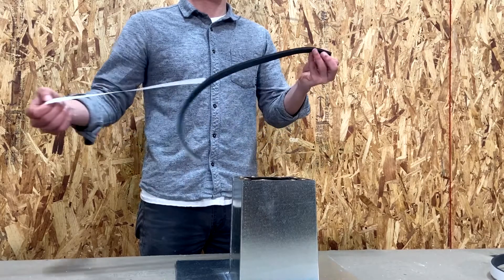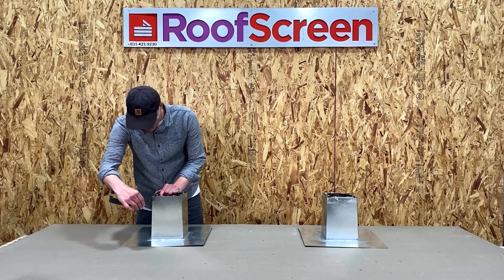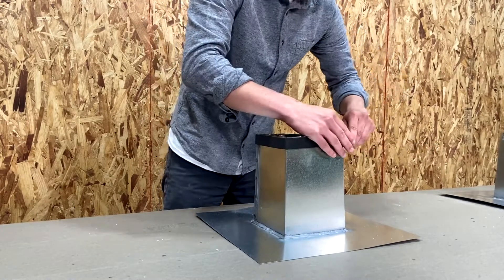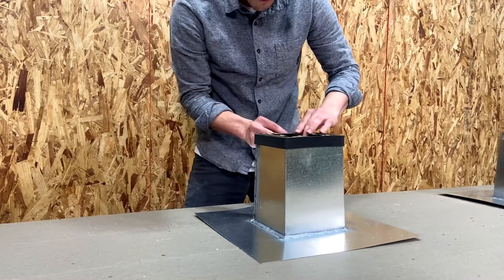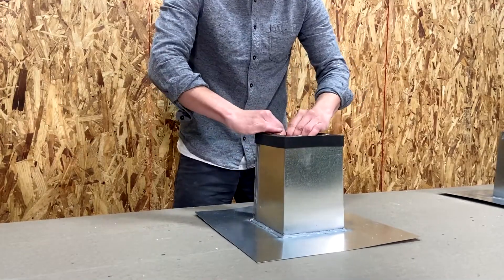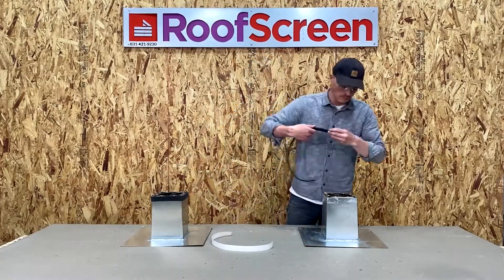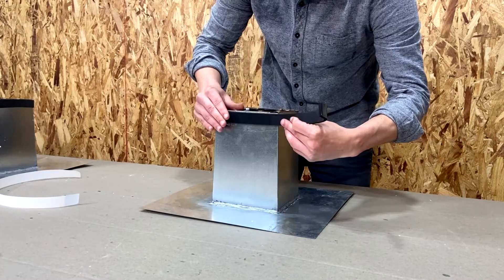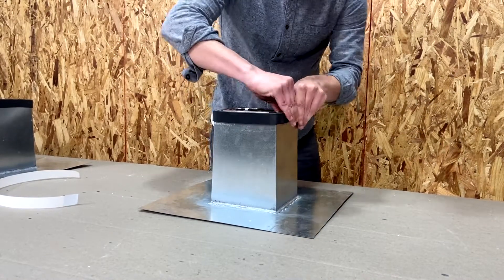The gasket is for added protection from moisture infiltration by snow, ice, and splashing water. I'm applying the sticky side of the gasket to the flashing, making sure the top edge is flush with the top of the flashing. I'm pressing firmly on the sides making sure that gasket is not going anywhere. Because each frame has two base supports, I am doubling my efforts with the gasket on the front base support, making way for the base caps.